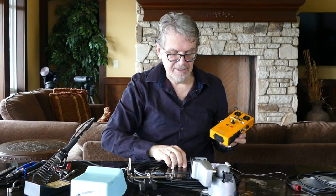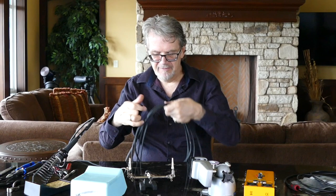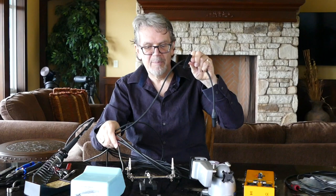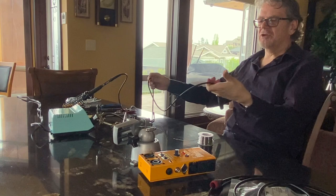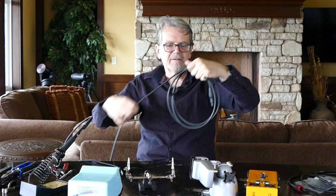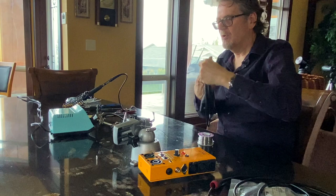The last thing I do with my cables is I always put a cable stay on them — this is just a Velcro type of cable tie. Pick one of your ends; I usually start at the female end, put it in, pull it up tight so that the Velcro locks into itself, and then it's ready to wrap on the cable. Here's a free final tip: the best way to wrap your cables so that they stay in good condition is to wrap them forward and backwards so that the loops take the twists out of the cable. Hold your hand with the cable facing your belly button — one goes on the front of your fingers, then one comes around to the back, front, back, and so on. Your cables take the twists out as you wrap them and you won't have to worry about a cable being all gnarled when you unwrap it live or in the studio.